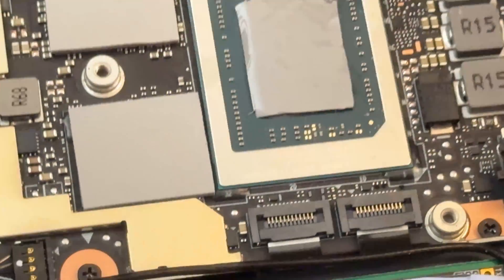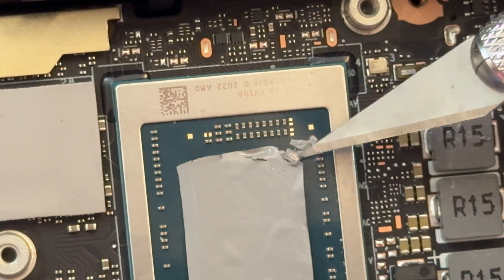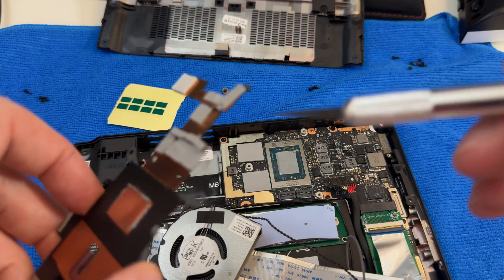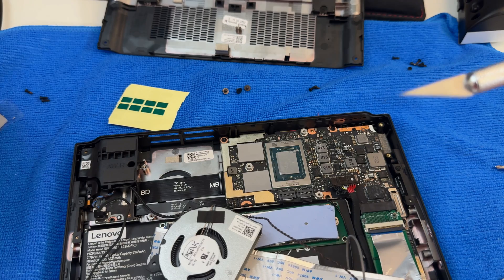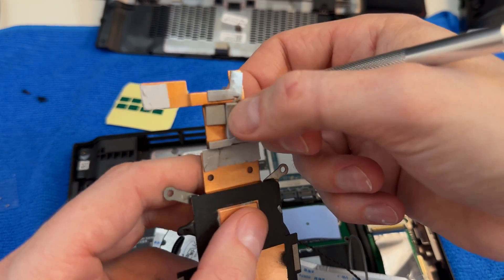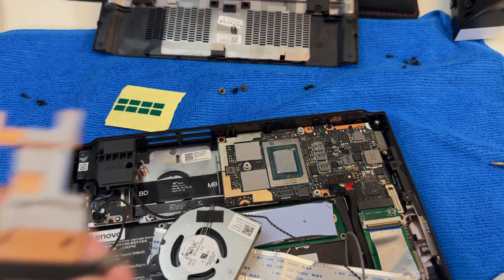If you see here, that area where it's a bit mangled is technically off the chip — that's PCB, not the chip itself. So I messed up that little corner but there's nothing under there technically. I salvaged the other piece. For the smaller component that had a slightly higher Z-height, I'm going to put on a little bit of this Thermal Right G-lid pad, since it has the proper thickness. It looks like they use a combination of one millimeter and half millimeter pads.